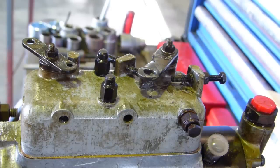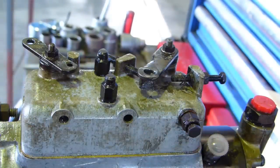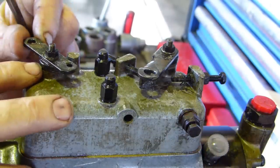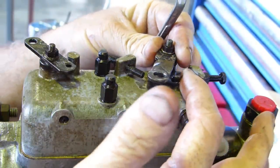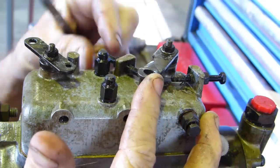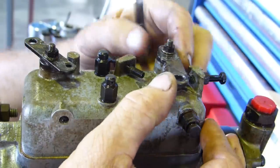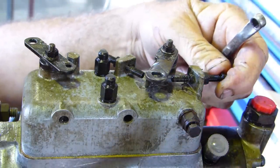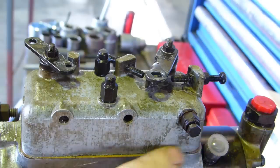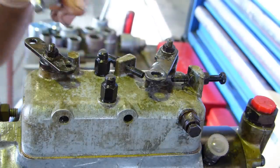I've turned the pump around. This is the side you would see when the pump is bolted to the tractor. You can see the bleed screw here and a lower bleed screw. Your tractor may just be leaking on these shafts. This is the throttle shaft with the screws - that's your high and low idle screw. This one here decides how much it can come back, and that's your idle screw. The one at the back decides how far you can open the throttle, how much tension it puts on the governor spring - that's your high revs. There's often a plastic cap over that so you don't open it up and rev it too hard.